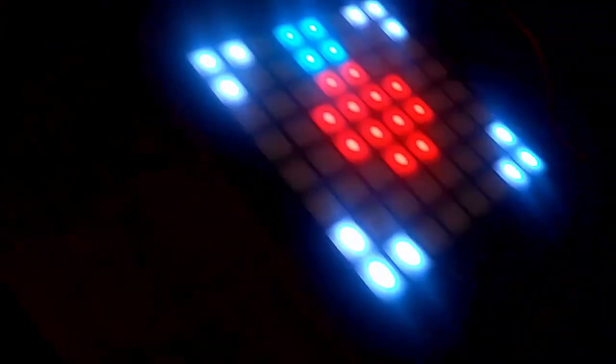So the Launchpad Mark II here has a system-exclusive message where you can set a specific pad, or really whichever note, to a certain red, green, blue value. Although these red, green, blue values are even less precise. They're actually 0 to 63. So you get 63 values, not including black, but that's for each of red, green, and blue.